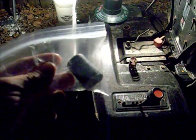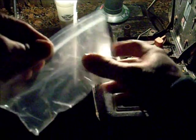Alright, we're also at the foundry. And this is my core. It's in CO2 and it's been in there for about 10 minutes, maybe a little longer than that, maybe 20. I'm going to go ahead and open it up and take a look at it while we're out here watching the foundry burn. It seems like it's pretty hard. A little dust on top and bottom. That's okay. We're going to take the tape off and see what we have.